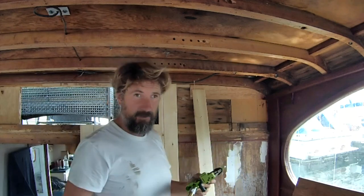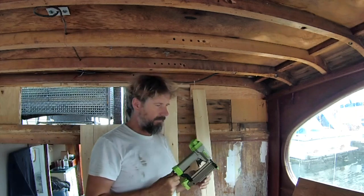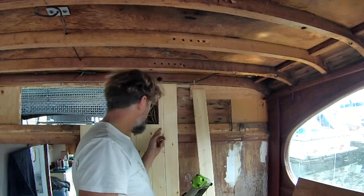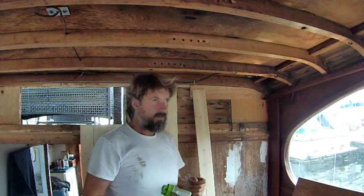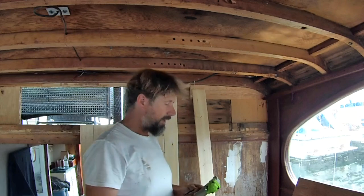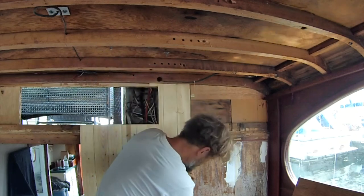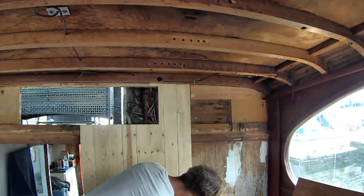Isn't it unusual that people have used nails to put this boat together while I'm also using nails? These are stainless steel nails. This is a 23-gauge pin nailer — it fires such tiny nails they don't even have heads. You can't see the holes where these nails have gone in — they're tiny. In stain work and paint work you pretty much have to give them just the tiniest fill. I'm only using five-eighths inch nails here because a quarter inch of it is in the V-joint and that gets three-eighths into the surface behind it.